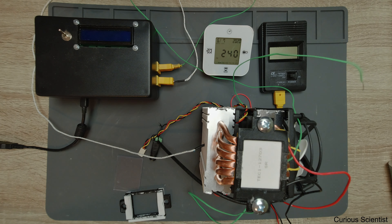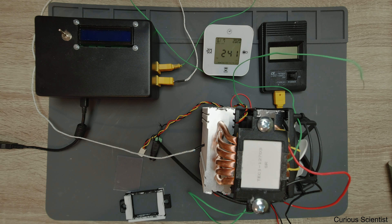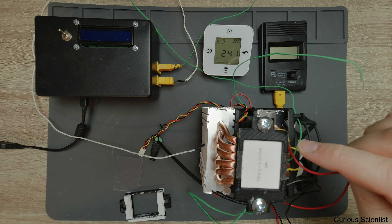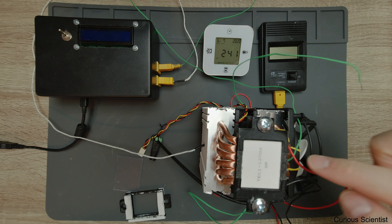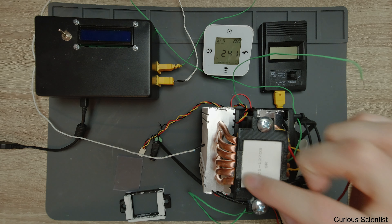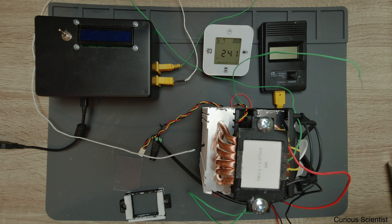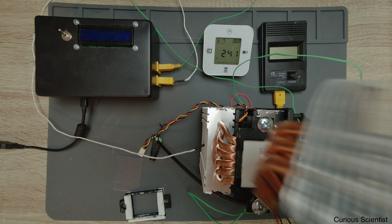If I had just started grinding or cutting the material, the printed layers would have fallen apart very easily. So instead, I redesigned the holder in Fusion 360 by removing material in the CAD software, then printed it again. There was some support structure remaining from the first layer, so I had to file that - not ideal. I also decreased the height of the part so it now fits properly.